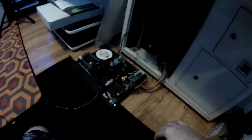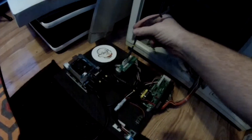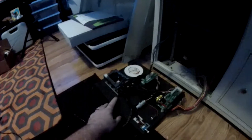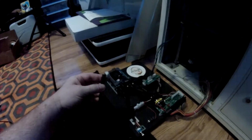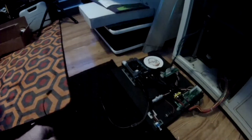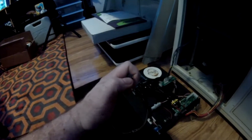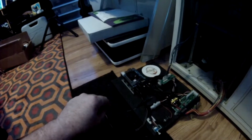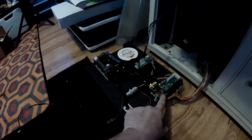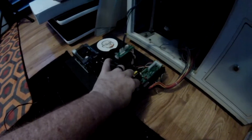All right, so here it is plugged in — just setting up so I can show you how it works. We have our JAMMA edge going in here, everything's on here. Our kick harness is wired separately on this cab and comes down into the little breakout board. The only other thing I need to figure out is the power lead — it currently splits for both the USB hub and the MiSTer. What I want to do is pull the 5 volt off the JAMMA edge and power the MiSTer directly, since it runs off 5 volts. I need to know what this barrel size is and the polarity — I'm pretty sure ground is on the outside and live is in the middle, but I'm not 100% sure. If you guys know the replacement connector I need, please link me to that so I can wire everything up to be powered off this 5 volt.